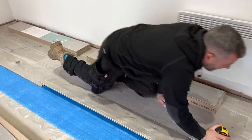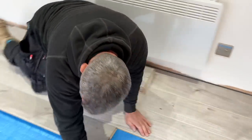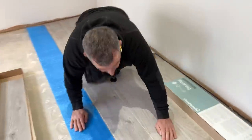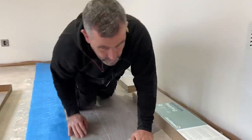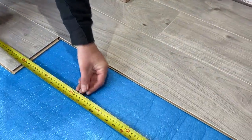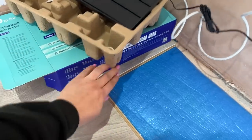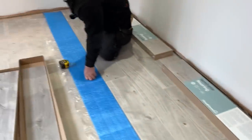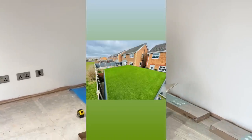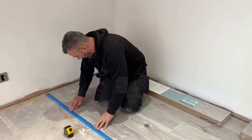David's giving me a measurement of 271. Jen's moving the Wi-Fi so I can get the measurement on the next board as well. They want nothing less than 300mm on your joint — I've got about 270 from there to there, so I'll save that piece and drop another board in there, then do my two rows at the same time. That speeds the job up a little bit.